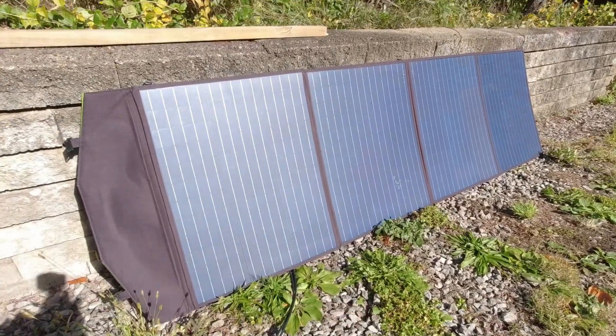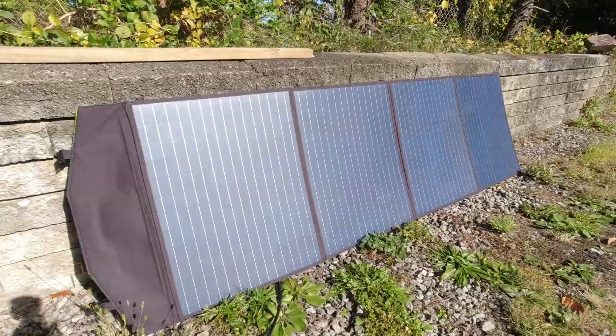I do have the EB3A which can take in about 160 watts, so I angle it sometimes for that. But the option to get 200 watts on a ground deploy in the summer is great — in summer the sun is overhead so you don't have to worry about angle, you can flat deploy and profit for the majority of your day.